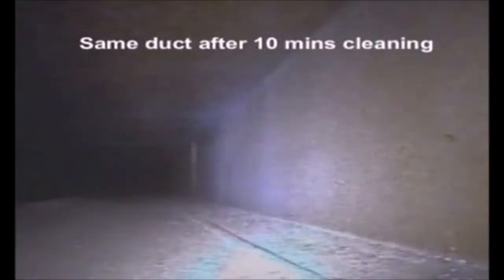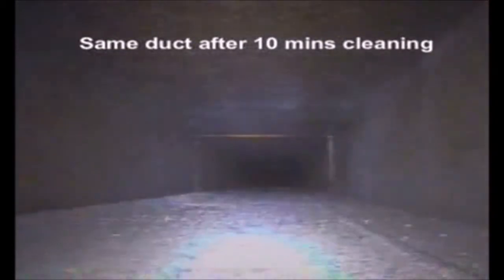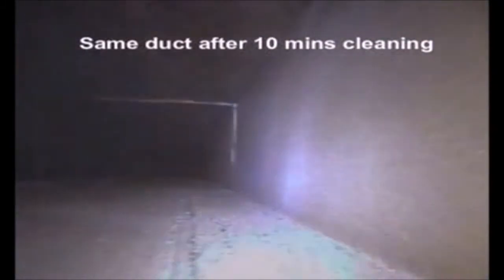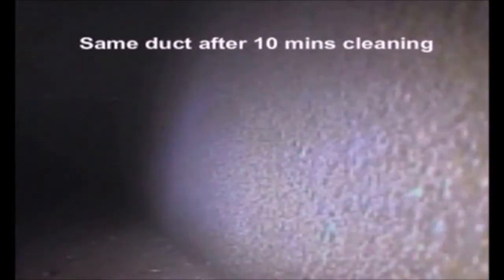the height of the duct, you can clean the whole length of the ductwork by rotating the brush to the right while going forward, and when coming to the end of that section and coming backwards, change the rotation to the left. The brush will then stay on the left-hand corner for the whole length of coming back. For example, a 300 mm times 300 mm duct is cleaned entirely in one go by choosing a 300/500 mm Tynex brush.